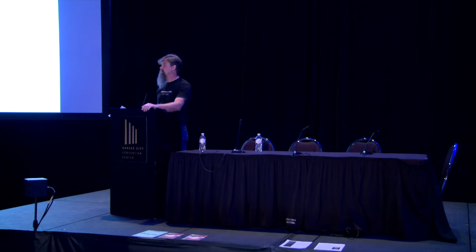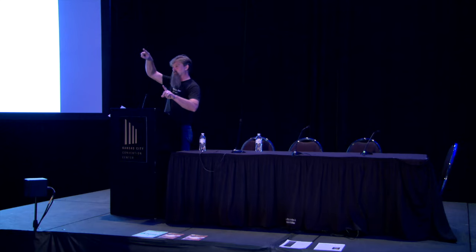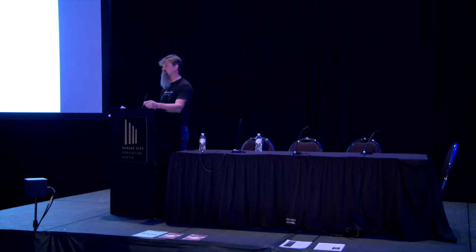So you said for cone 10, yes. What about just cone 6 and bisque fire? For cone 6, you're going to see some savings, for sure. I think it's sort of up in the air, if you ask me. Are you doing a lot of hard cool downs, powered cool downs, that kind of thing? Yes. Because heat works not just up, it's down, and elements decay when they're energized. So the longer they have power, the faster they wear out. So yes, for 6, I'd say sure, APMs are worth it. Thank you. You're welcome.